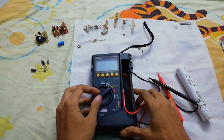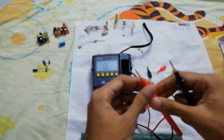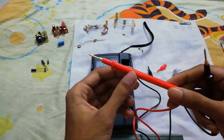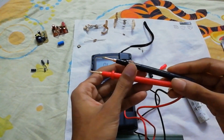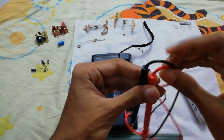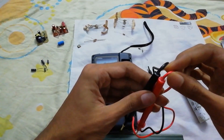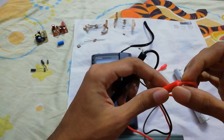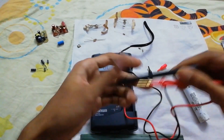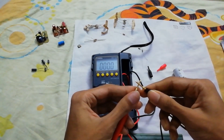Okay, let's do a continuity test. The Sanwa branded probes are nice quality, but they are not rubberized. They have a nice gold-plated tip. But one thing I noticed is not good — there is no strain relief, so this probe may be damaged. I have put some glue over here to protect it, and maybe I can put some rubber there as well. Let's measure the resistance of the leads — it reads 0.00, so that's nice.